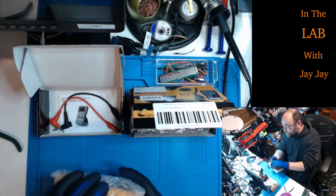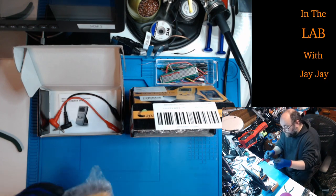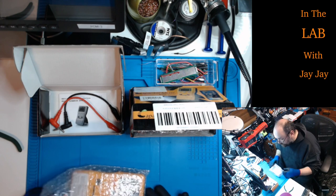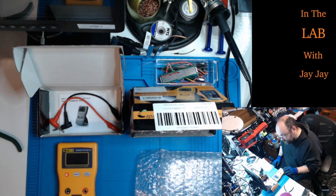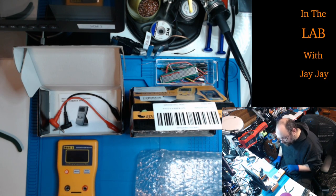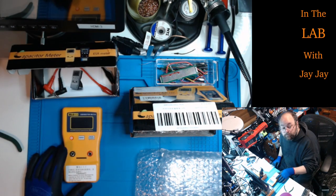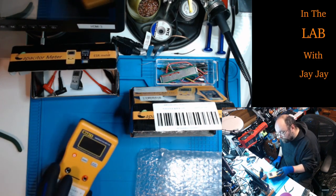So on the one hand, they've sold you a capacitance meter. Now this should just measure capacitance, and capacitance, of course, is measured in some fraction of a farad. So that's what we'll expect to see from this guy. Before testing, you must discharge the capacitor. Can you see that? Put him on the bench here. Before testing, you must discharge the capacitor by short circuit or resistor below 100 ohms for 2 seconds, or you may damage the meter. All right.